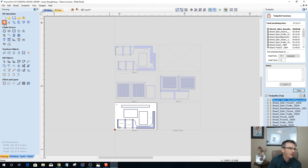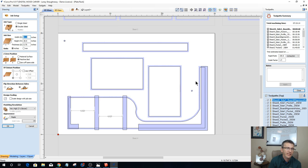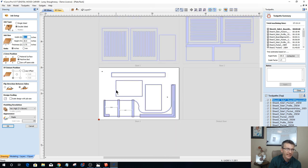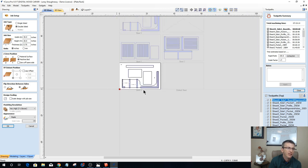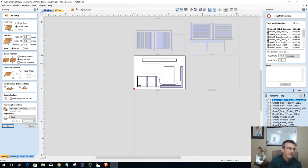And again, the sheets are 30 inches along the x-axis, 20 inches along the y. And if I were doing these out of solid wood, my shelf boards and all would be solid, not plywood or edge banded plywood or anything like that. If I were doing these out of solid wood, then I would be breaking this out even more. My three big pieces would be in a separate project, and then my individual smaller pieces would be in individual projects, not all together nested as one. And I would still be using a 30 inch long by 20 inch panel that I have glued up.